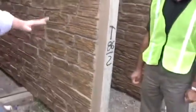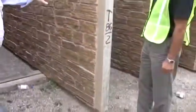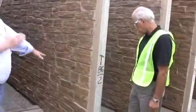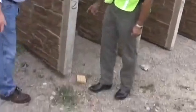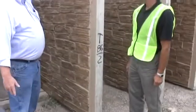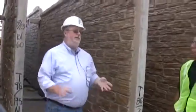Now, when you support it at this point and that point, will it make point stresses? No, it's designed to handle that. This is a dunnage point, and I believe they're at 5 feet in from the edge. That's calculated by design. The structural engineer tells our people where to put the dunnage, because you don't want to put it all the way out on the edge here, because your rebar and everything else might be a foot inside. So if the rebar is not in this area, you'll start getting a crack right along there. That's a stress crack.